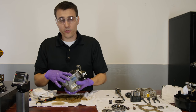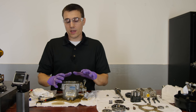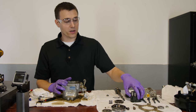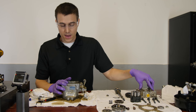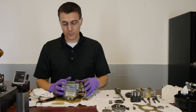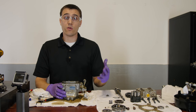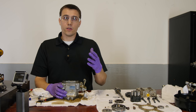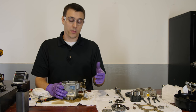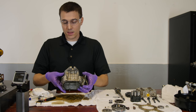The general rule of thumb for a pump is: if any rubber materials are worn, it's worth fixing. If any metal parts are worn — like the cylinder barrel or the cylinder head — then it's generally not worth repairing; you just want to replace the whole thing. Also, if you have a seal failure but that pump has a lot of hours on it, you could be putting a lot of labor into replacing a seal when you may as well just go ahead and replace the pump since you're in there anyways. So those are some considerations and things to look for in the pump.